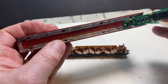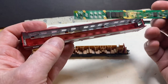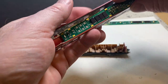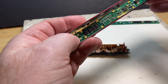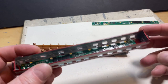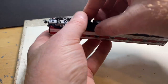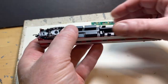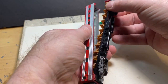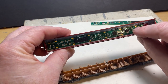The first thing we do is put the board loosely inside. There are always some alignment pieces inside — snaps or something. This board is 11 and a half millimeters wide. We drop it in and it just fits. The next step before doing anything is to put the car back together and make sure there's enough clearance. We came very close but not quite — the issue is the capacitors, CPU, and regulator stick up a little bit.